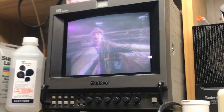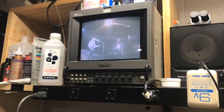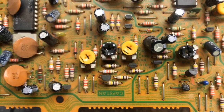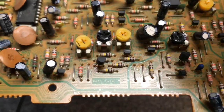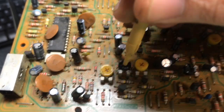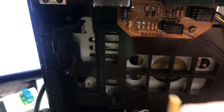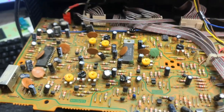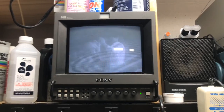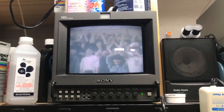The first thing I'm going to do is go down to the proper speed capstan free speed adjustment. It'll say '2H cap' — it's that black trimmer right in the center. I'm going to take a tweaker tool here. It's hard to do this with one hand. I'm going to cheat and just use the screwdriver — you'll see as I start to turn it, it'll clear up. I'm turning it clockwise. You'll see the snow change consistency here.